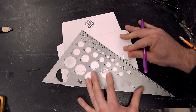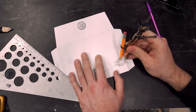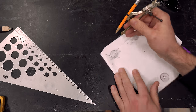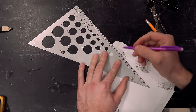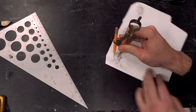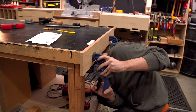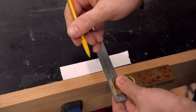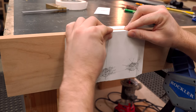This is a little geometry trick where you draw two lines — pretty arbitrary as long as they intersect on the edge of the circle — and then use a set of dividers wider than halfway of those lines and draw an arc from all three points that intersect the outside of the circle. That results in a couple of eye shapes, and if you connect those two eye shapes together they intersect at the center of the circle. I know it may sound complicated but once you've done it a couple of times it's pretty intuitive. I temporarily clamped on the sideboard, left it a little long on one side, then used the center mark and that paper template to mark off the center points of the circles I need to drill out.